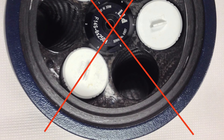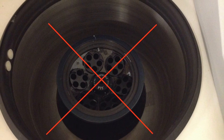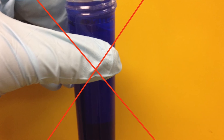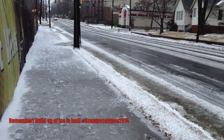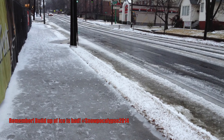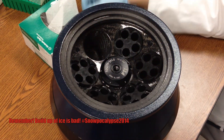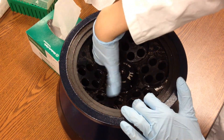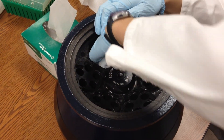Do not imbalance the rotor. Do not leave the lid off. And do not overfill the centrifuge tubes. During refrigerated spins, condensation on the inside of the centrifuge can become frozen, causing the rotor to stick to the spindle. In this situation, turn the centrifuge off and leave the door open so that the inside of the centrifuge can warm up. The rotor should be easy to remove once any frost has thawed. Also, be sure to wipe out any condensation from the rotor to circumvent future imbalancing.